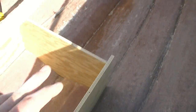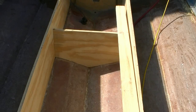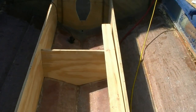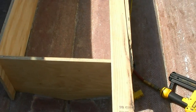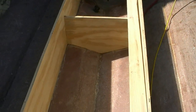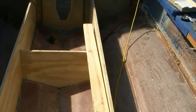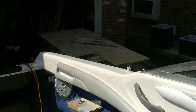I've got more grinding to do. I'm going to do the board cutting first and then I'm going to take all this out. A little tip: what I use is my little DeWalt brad nailer to tack this stuff in place. You don't nail it together all the way — I just put one tack, like you're tack welding a piece of metal, to hold it together so you don't have to worry about things falling over. We're going to pull all those out whenever we put it together, but at least it holds it for now and we can finish our framing mock-up. What I'm going to do is use those old stringers as a tracing so I can trace them and make them a little bit higher.